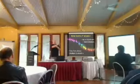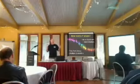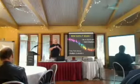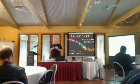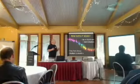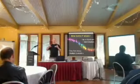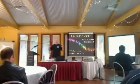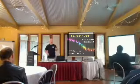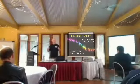Each controller sits on there, and in the DMX world it only looks for the data it's concerned about. So you do that when you set up the controller, setting their start channels. If you set a controller for a start channel of 101, and it's got 16 channels, that controller will look for data starting at 101, going to 117 in that data stream. And that's all it will react to.